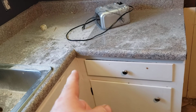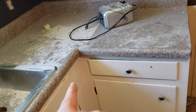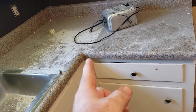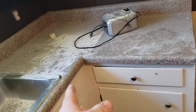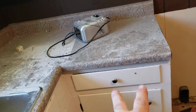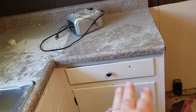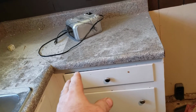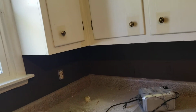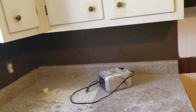To do that voided corner, one of these fillers will need to be a 6-inch filler. And the other filler will be a 3. So make sure that when you're doing a return here, I need 3 3/4 on one side and 3 inches on the other. Order me a 3 and a 6 for this corner. That's going to make this a 21-inch cabinet base, and it'll be no access or voided access to the corner. That being said, too, I need to have a 2x4x8 for the ledge in the back. That's item number 6005, and that will be all we need for the left-hand side.